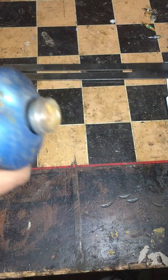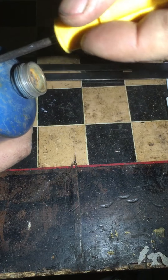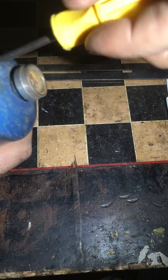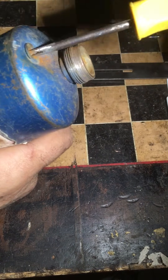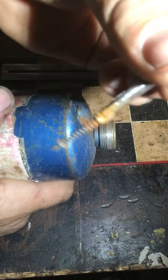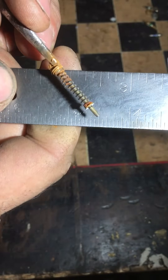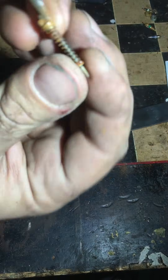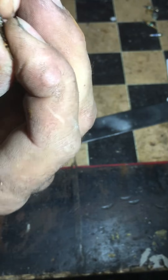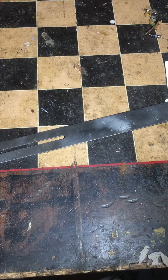We're going to take this tool and go in here, and it should click in — there we go — and we can feel it turning. There's a bunch of rust coming out, she's turning. And there we go. That's what the rusted old Schrader valve on this tank looks like. This is the outpressure valve, so if the tank becomes overpressurized, the pressure's going to open up this way and release — preventing the tank from exploding if it were to heat up too much. It's just going to outgas. So that's our first valve, and the second valve is a little bit trickier.